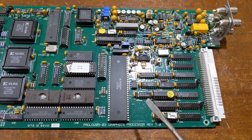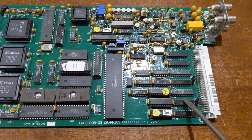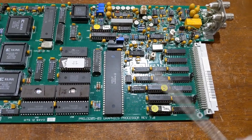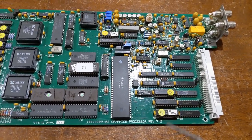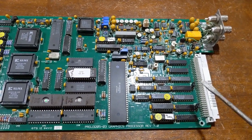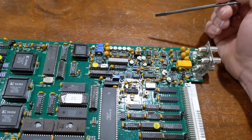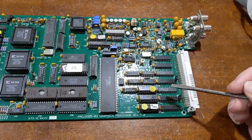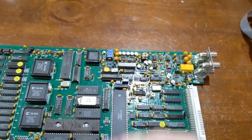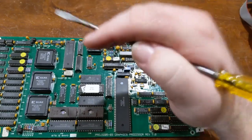So what you would do is you would set the vector latch, known as IVEC, and then you would send an interrupt request, IRQ, which we can get into a little bit more specifically later, back to the CPU. So then the CPU knows that this card triggered an interrupt, which will allow the CPU to read the interrupt vector address. And then you can have your interrupt vectors written a specific way. So depending on what vector is written here determines which code executes.